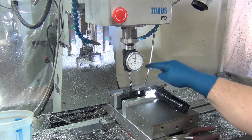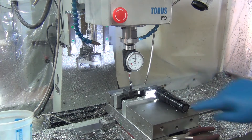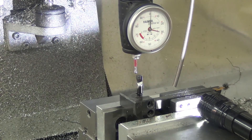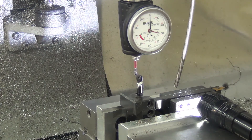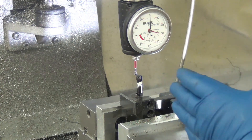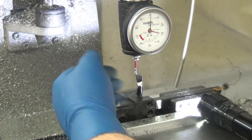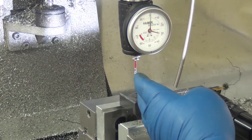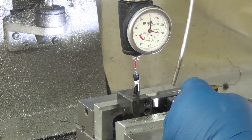It helps if I take a flashlight and light up the background — then when I get down here and eyeball through, I've got a bright background to see. The shuttle gives really nice fine control. Eyeballing that sucker, make sure it's pretty darn close to center. I'm lined up in X, and it's a whole lot easier for me to line that up visually. For Y I'd have to use a mirror or climb up in the machine, so I get the X first, then move that back.